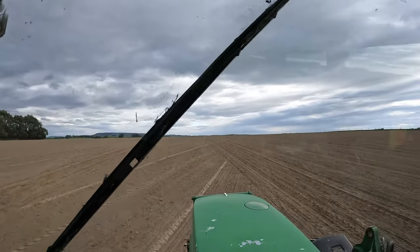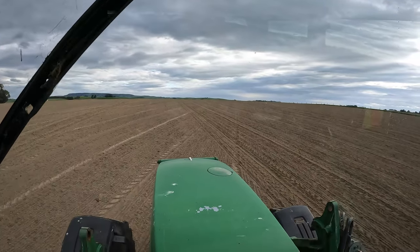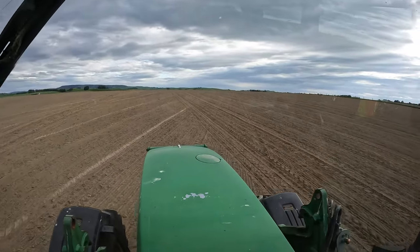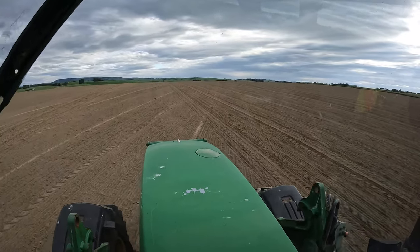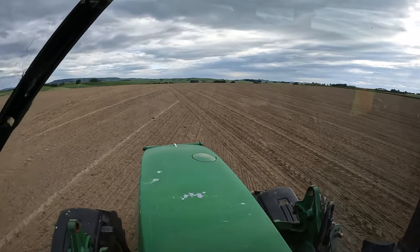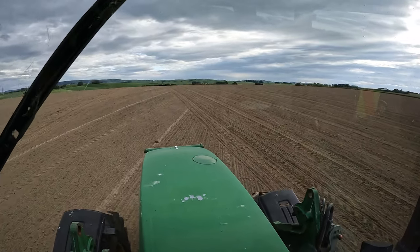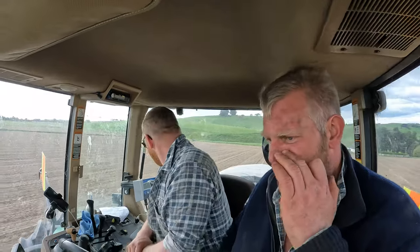It's pretty low cost. The big thing we're looking at is how deep the units are sinking in, basically, isn't it? Like, the units are able to do their thing with the rows they're making. Yeah. And they're not gouging. We're not making trenches, because if the paddock's too soft, it winds up looking like you've ridged it. Yeah, except that you're seeing all of the bottom of the trenches, which is great if you're worried about sandblasting, and not great if you're worried about drowning plants. But ultimately, you've got to get that soil consolidated.